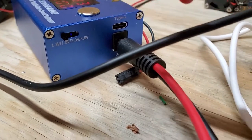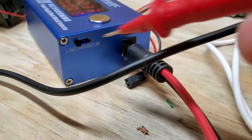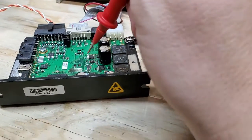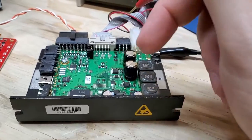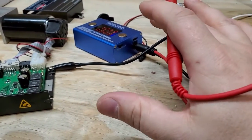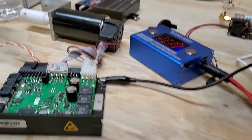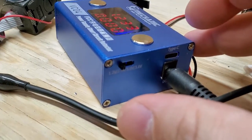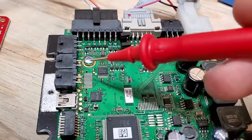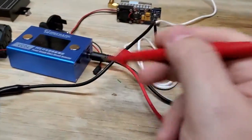So let's say my motor drivers are rated at 5 volts — I look up the chips on the datasheet, find what their VCC is, and I would switch this to 3.8 volts, or maybe even 1.8 volts, because you do not need a lot of voltage. We are not powering the board to turn it on. What we are doing is injecting voltage into an area and then finding which component is heating up — that is going to be your short. Without a schematic, this method is very effective.